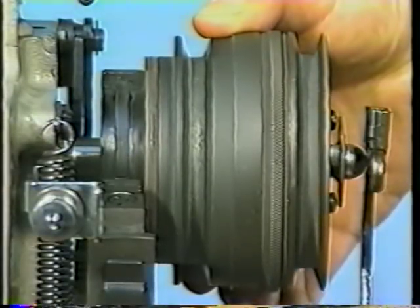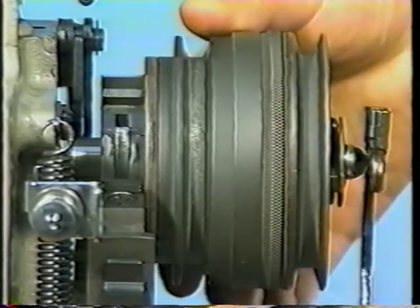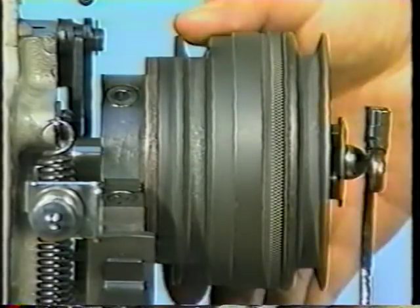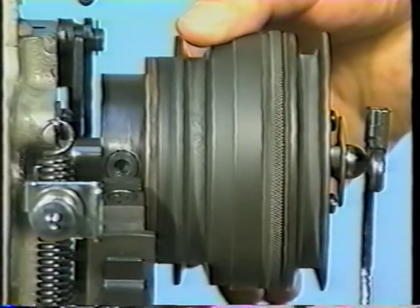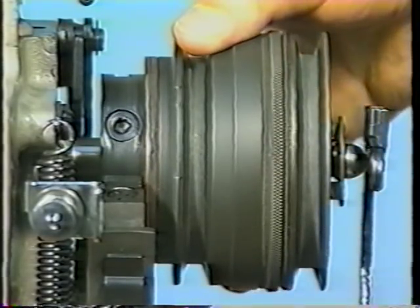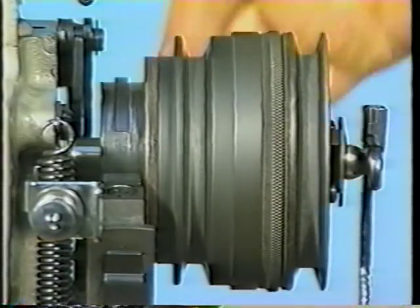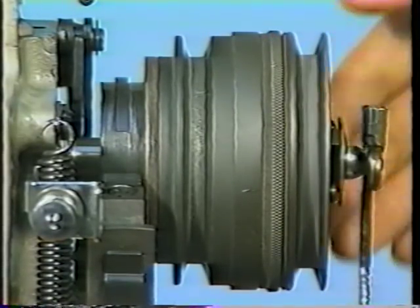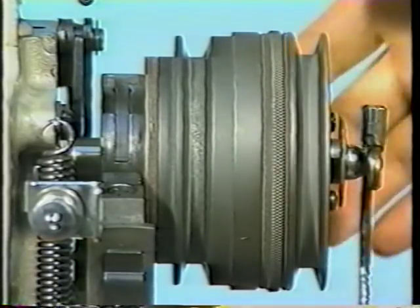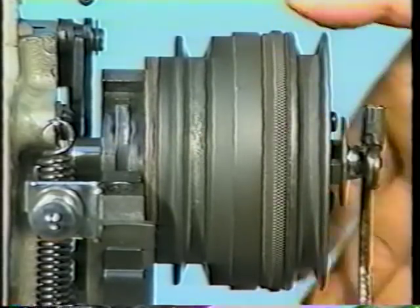When the sewing machine changes over between high speed mode and low speed mode, the changeover pulley moves away from the high speed pulley and low speed pulley. As a result, the changeover pulley is now in the released state. In this state, the sewing machine runs by inertia, and the changeover pulley comes in contact with the high-speed pulley and the low-speed pulley.